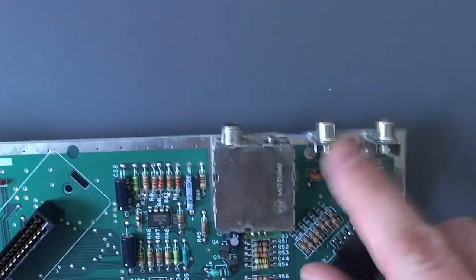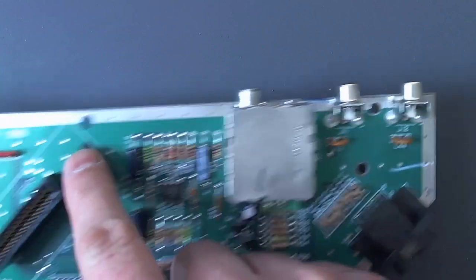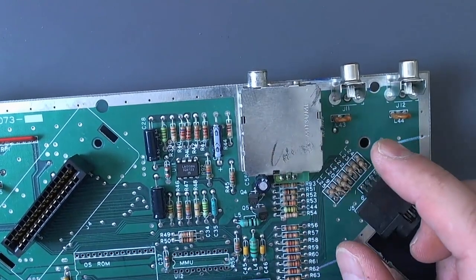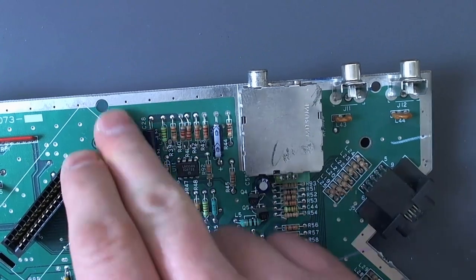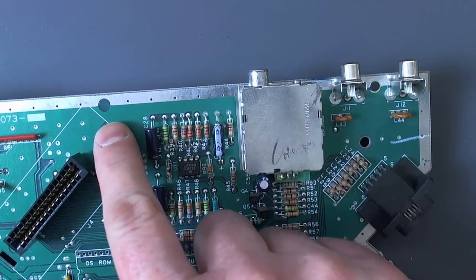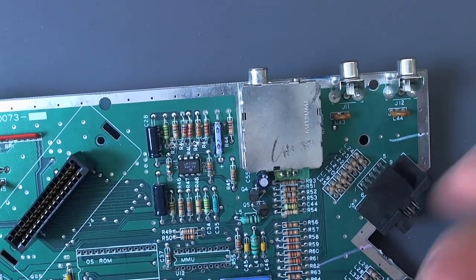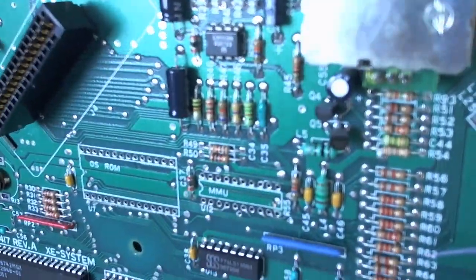The board's already got phono jacks for audio and composite video on the back, so instead of putting the normal 5-pin DIN plug for video, it would be a bit pushed for space if we're going to leave this on. I suggested a board-mounted S-video cable where we can bring our YC video — which has to be patched into the video circuit back here somewhere. I'll have to use my machine as a reference for that. So that'll be your Chroma and Luma, and composite video will still be over here. Audio is already taken care of so you don't really need to make a custom cable for the customer, which is always nice. We'll have a look at those traces — always double check.